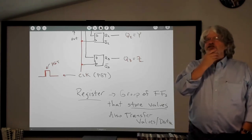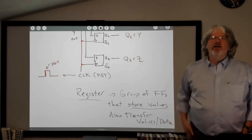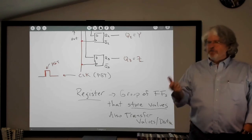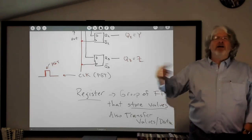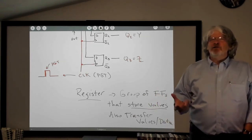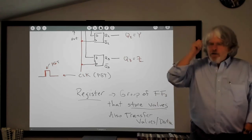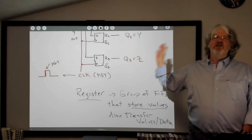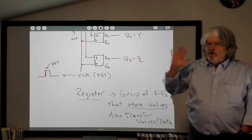The serial stuff has just gotten so fast, and the electronics can switch much faster now, so it's just so much cheaper to use a serial interface. You see this in your computer — your hard drive is SATA: Serial ATA. Your data is being sent back and forth serially. Remember the PATA interfaces — those big old ribbon cables, the parallel ATA interface? Back then having a wire for each bit was much faster than anything serial. But today the economy and speed of serial has taken over. That's why we're all using serial now.